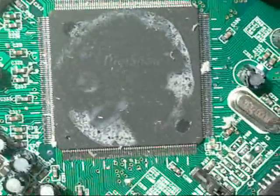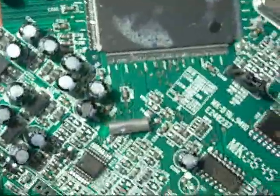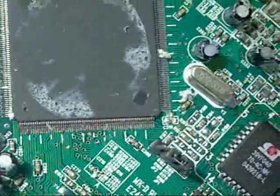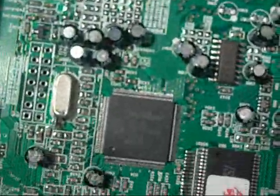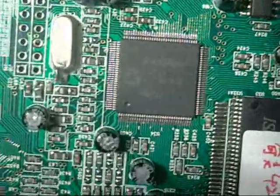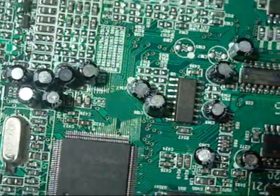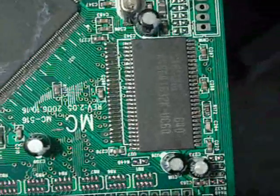Okay, well I've sacrificed this board just for the sake of the investigation. Chipsets on it are DigiShow. This one here is DigiShow Sun Plus SPV730A. And this one here is DigiShow Sun Plus SPV516B-HL091. Samsung memory chip by the looks of it. I think it's a speaker or something there. Audio drivers. These aren't even glued down so they can vibrate all they like. Very lousy design attribute.